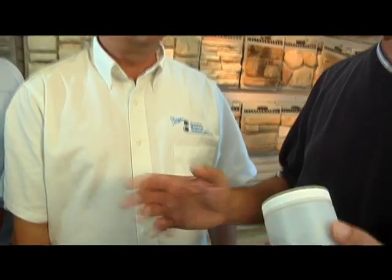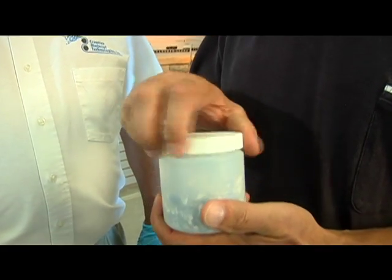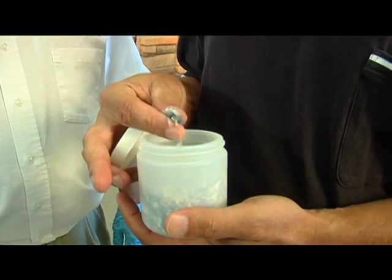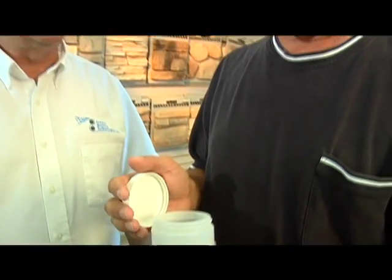Now, once you do that, I got the fleck here. Do you have to do small amounts of the floor at a time and then fleck it and then move to the next, or does this material have to all be done at one time? You can do small areas and fleck it area by area, and then when it sets up, you can blow off the excess flakes. I'll bet the real tricky part is getting this the same in one corner as it is in the other corner. That's why we use gravity. We throw the fleck up in the air and let gravity do the work.